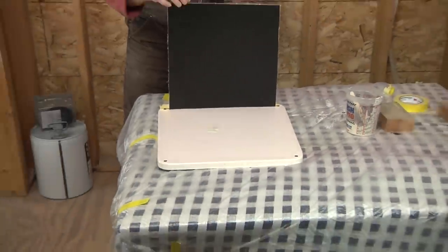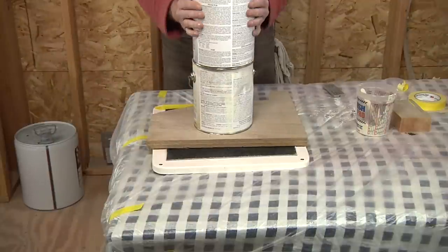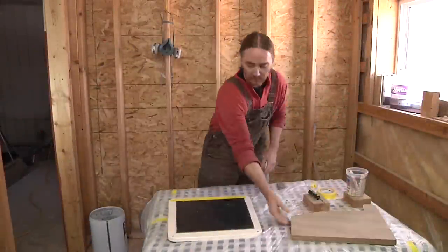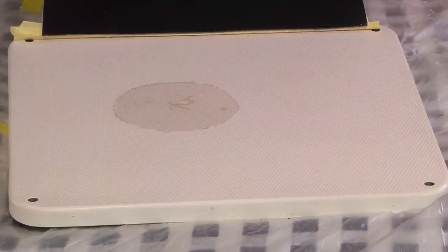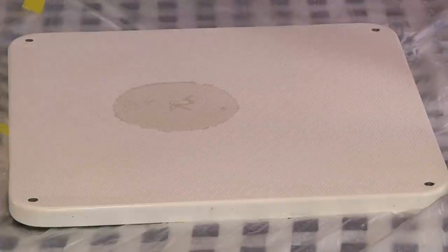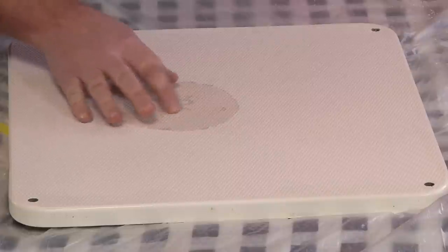Be very generous when you're pouring in your gel coat. You want the excess to squeeze out and you need to make sure that you have enough gel coat laid into your repair area to completely fill it and give you a good positive casting. This panel happens to be perfectly flat, so I'm laying a perfectly flat piece of plywood on top and weighting it down with two cans of paint — probably 10 to 15 pounds between these two cans. It is the following morning, so let's peel this off and see how it turned out. It all popped up. I think we're in good shape.